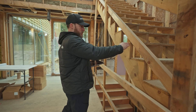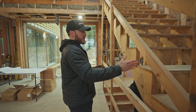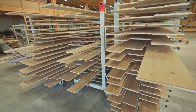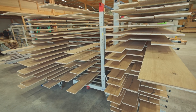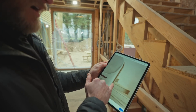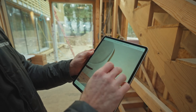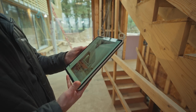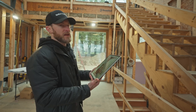After that we're going to be installing our plywood tread as well as our plywood riser. And then on top of that we're working with Madera — Madera actually fabricated all of the stair treads for us and they're all pre-finished. You can actually see it in the rendering, and you'll see how the treads actually hit our plaster wall, which is continuous all the way up. We'll get to the skylight here in a minute.